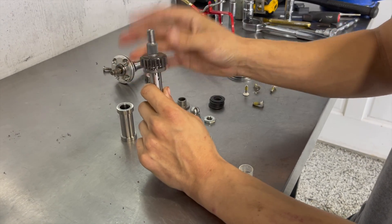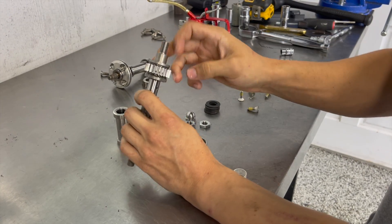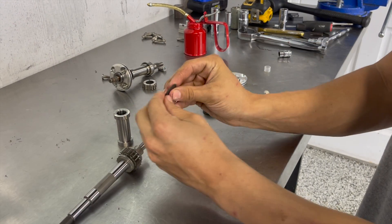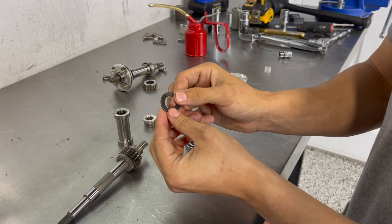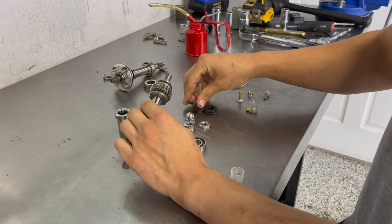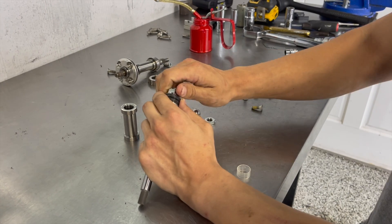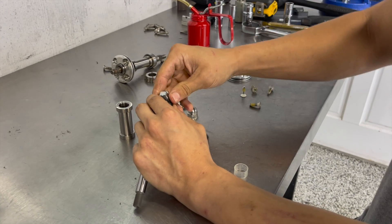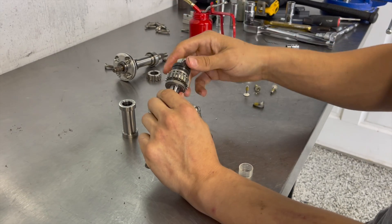Then the additional clutch washer will go on there. We've got this collar that will hold the spring washers that keep tension on this and designate the slip. Now these spring washers are directional — it's going to be nearly impossible to see on camera but they're not completely flat. I will put these in the correct orientation and then we can thread on the nut. This one we're not going to put any Loctite on. We will put Loctite on the other one after the slip is set. This one applies tension to the spring washers and collapses them — that's how you get your slip movement.